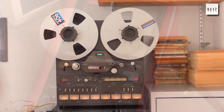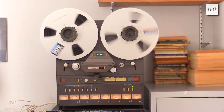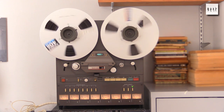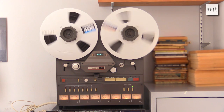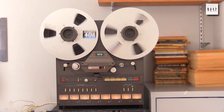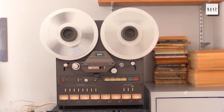So let's reload the tape and see what happens now. There we are - a little bit of crackling as the tape comes off the spools, but then again this has been standing for a very long time. Much cleaner, no sign of squeal and virtually no friction. You can even feel the tape feels a lot drier as you actually handle it - this felt quite sticky to start with.